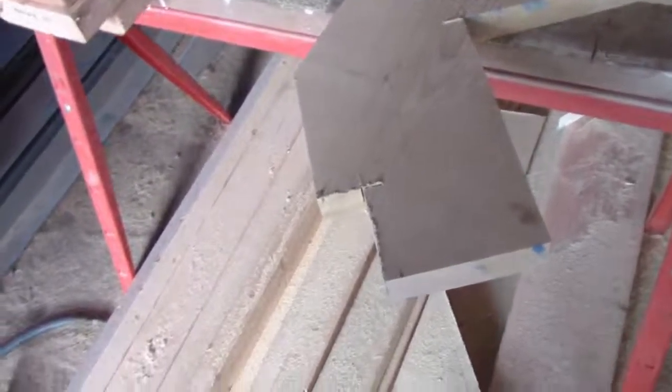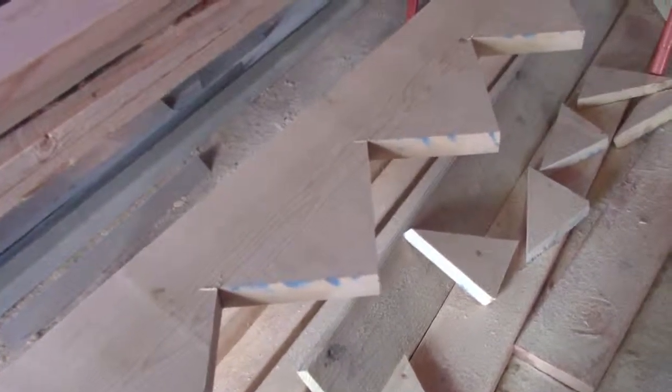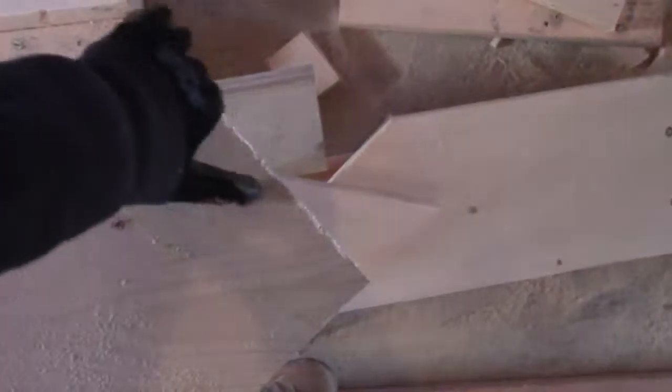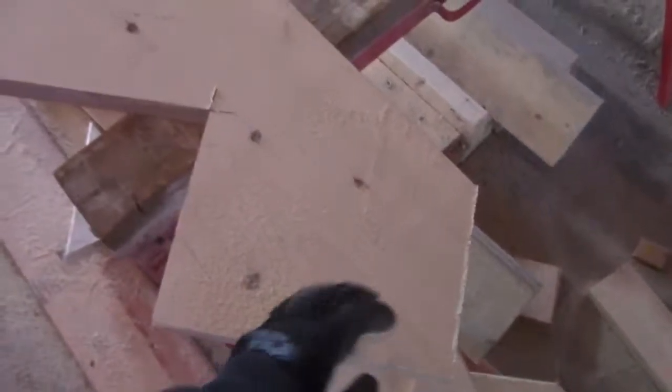It's just because of the way circular saws are. Just lower the depth as far as it'll go and overcut about 1/2 or 3/4 inch. So we got all these cut out, and then we got our top up here, which we just lopped off after our 10 inches of last tread here. And the straps, we're going to secure these with metal straps.